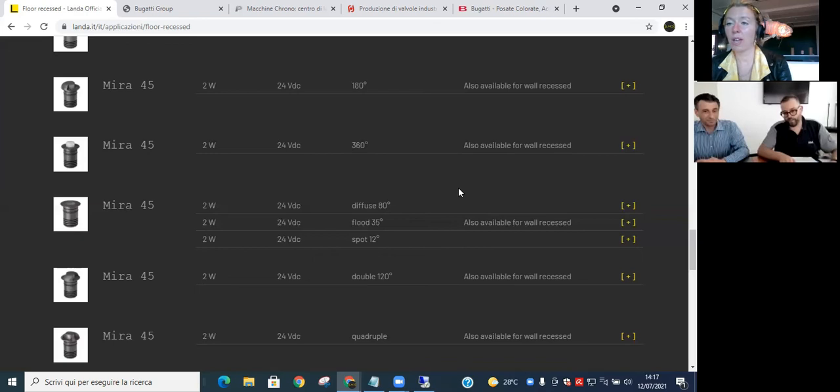If you use the Lyra or Mira — which is turned aluminium, not die cast — they are perfectly fine by the sea. Even on the die casting, there have been very few problems over the years. Issues are usually down to installation damage — scratching the paint work during installation, or people cleaning fittings with materials that wear down the protective coating, which I've seen before with other brands.